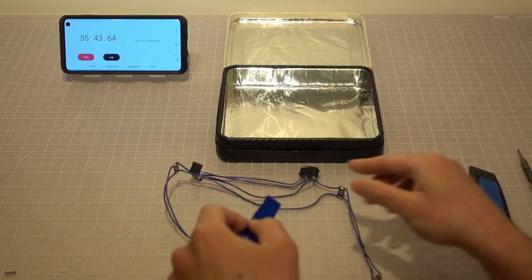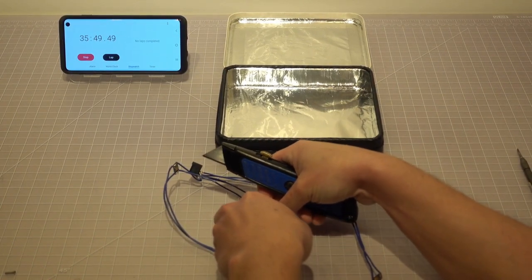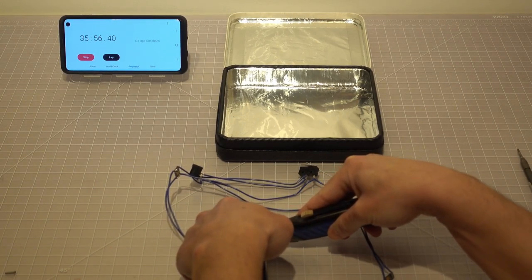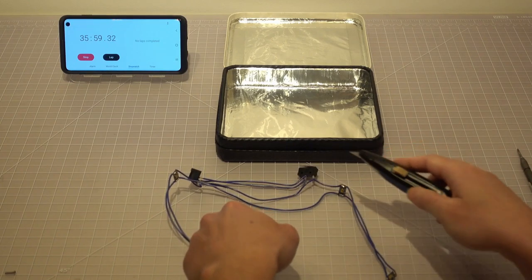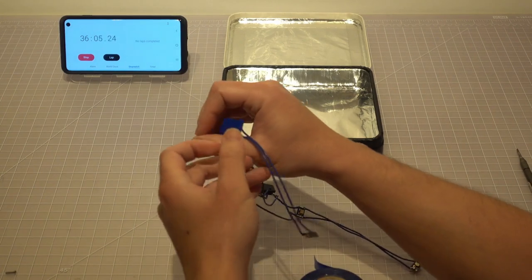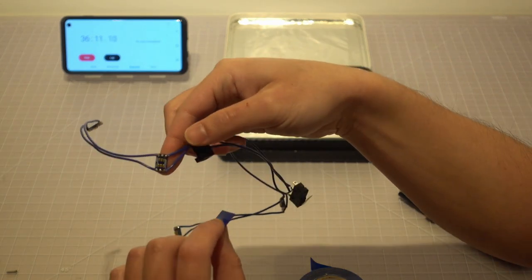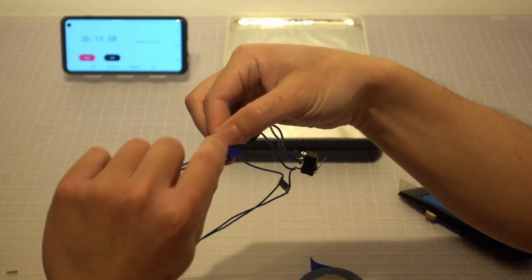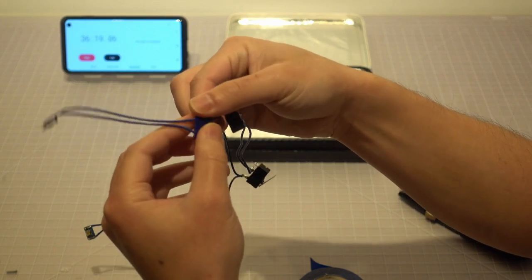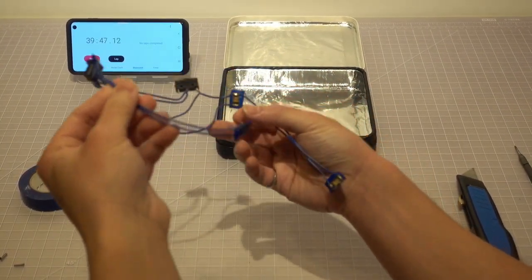Cut a piece of the electrical tape just bigger than the LED breakout board. This piece of tape will be attached to the back of the breakout board to prevent any short circuit that may happen when the board is mounted onto the metal surface inside the box. Make sure the entire breakout board and the solder joints are covered, so that no conductors are exposed. Repeat this procedure for the other three breakout boards.